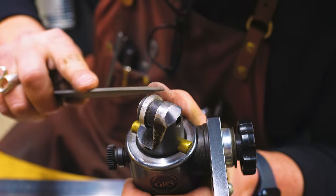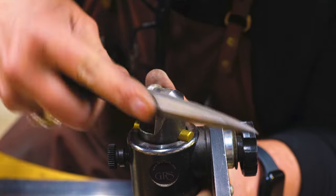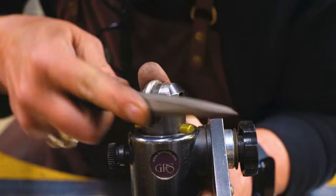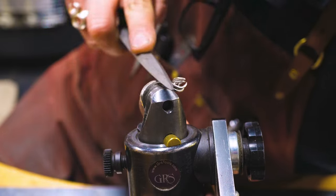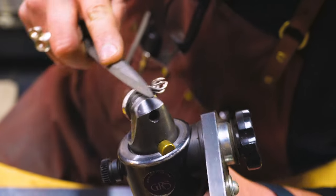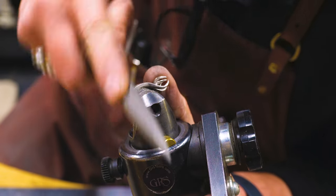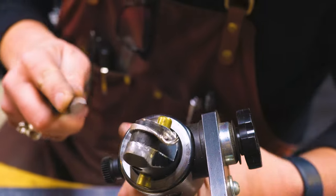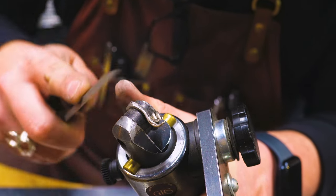The light actually shows you if you've got a light reflection on your ring — this is in a matte format now. If you're looking at the light, the reflection will be smooth and then you'll see a little kink, which is a telltale sign that something is interrupting that light's reflection. By looking at the light itself, you can file until that reflection is consistent all the way around your ring — this way you know it's absolutely smooth. If you've got any distortion of the reflection, going slightly down in one spot, you know you need to remove a little bit of material there. That's my tip for today's video.